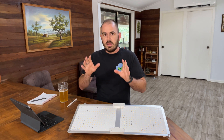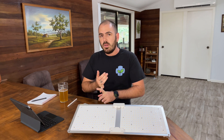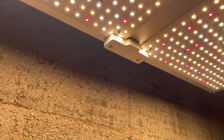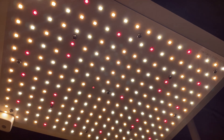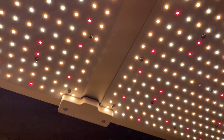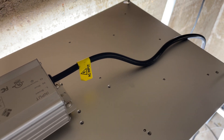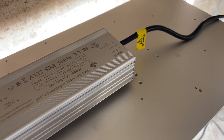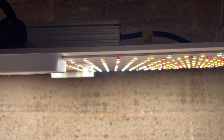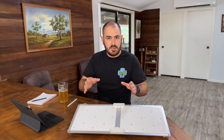That being said, let's have a look at the specs. This is a 220 watt light — we'll test that in our PAR test with a watt meter. It's a full spectrum SMD over a PCB on a fanless heat sink. The LED diodes are mounted on the surface of a printed circuit board, which transfers heat through the back of the PCB through thermal paste and into the heat sink, which passively radiates the heat away. This is the direction most LED lights are going these days — they're noiseless, no moving parts to go wrong, and a lot cooler than running an HPS fixture in a small area.